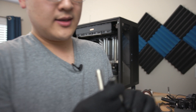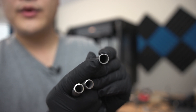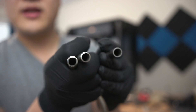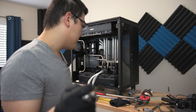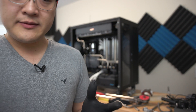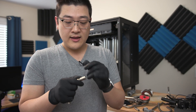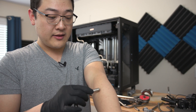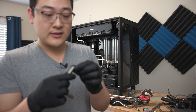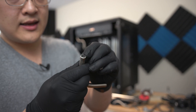The end result is something like this — you can see at both ends of the cut. This tubing is one millimeter thick, but the cut end is clearly thicker than that due to material being pushed in. The outside of the cut is actually very smooth from the blade, so you don't have to worry much about it cutting O-rings. What you really need to worry about is the inside, which can be sharp.